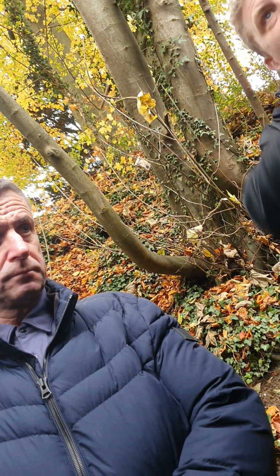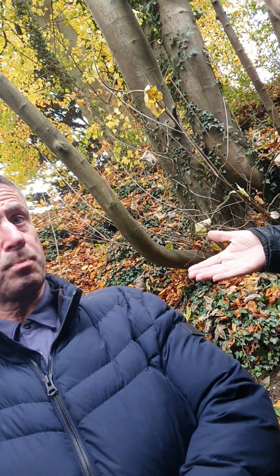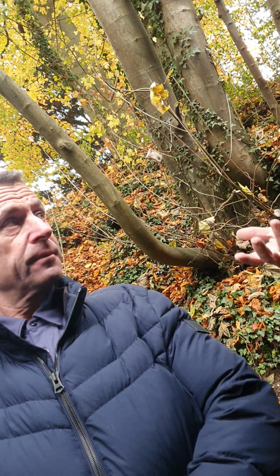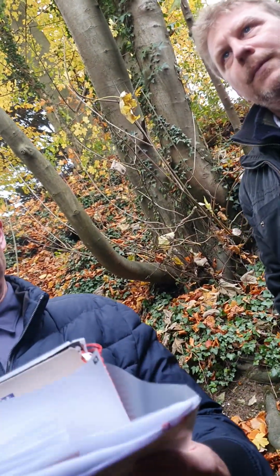As a minimum, you'll need a slab across the top, and you'll probably need a balustrade up the side, which is all in a public walkway. But then the actual finish, I think, needs a bit of thought. It could be dirt, or I don't think it needs to be tarmacked. We need to negotiate that a little bit and work out what the client wants. It doesn't need to be blacktop. We can go through some options. It's probably a lot of walkers, so you want some protection from falling over the side.